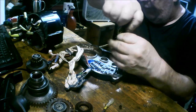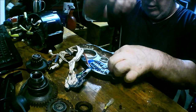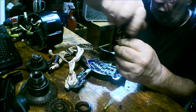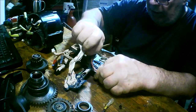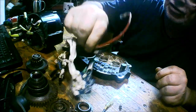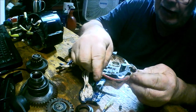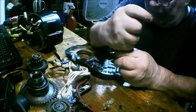The main positive is corroded for the battery connector — there is definitely corrosion on the board. Here's the ground, and it's got five screws that hold all the wires in — power and ground. That board is the main board. You can see the corrosion on the power side. Hopefully this board pops out of here easy enough.